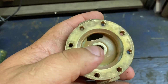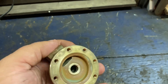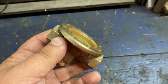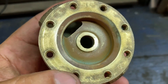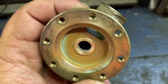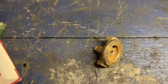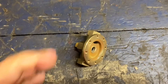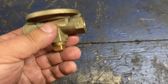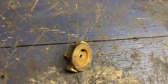If you don't know anything about these valves — as long as the incoming has a restriction fitting before this, so as long as more can't leak by than is provided by the restriction fitting, it'll seal. And I am 100% confident that that would work no problem. I have a lot of experience with these valves. There's a nice shoulder there. I forgot where I put the diaphragm, the rubber part, but I'll get that cleaned up and we'll get her out the door. Another quick little project — I've been trying to show you guys more machining stuff. This is the kind of stuff that comes through my shop. This is Adam for Small Town Machine Shop. Please comment, like, and subscribe. Thanks for watching.